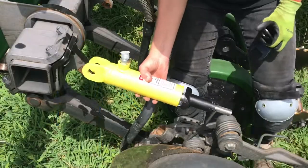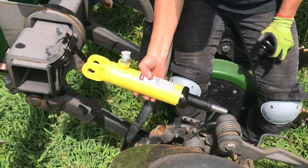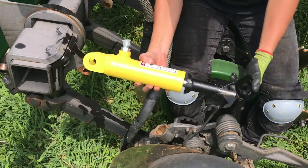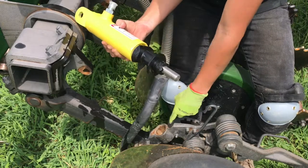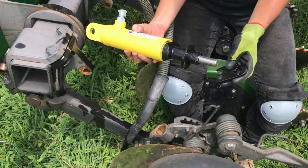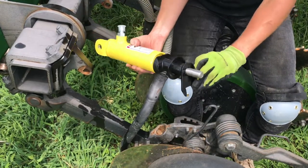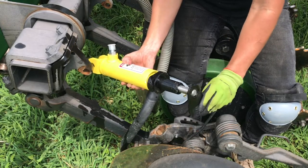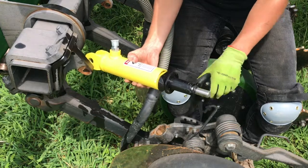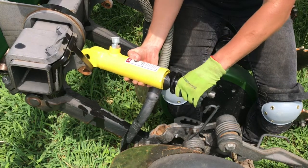When installing the cylinders, before we actually put it on, just some notes of how it goes on. As you put the washer, you slide it through the housing here, and then when it's through there, you want to make sure that this notch plate locks into place. See the notches here on the bushing, and then this washer — you want to make sure those lock, as that keeps the bushing from rocking side to side.